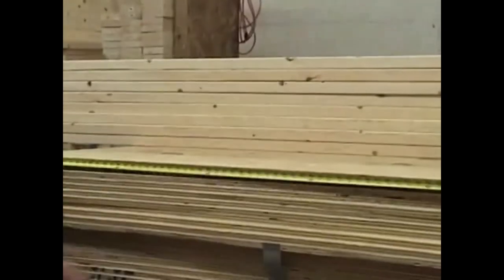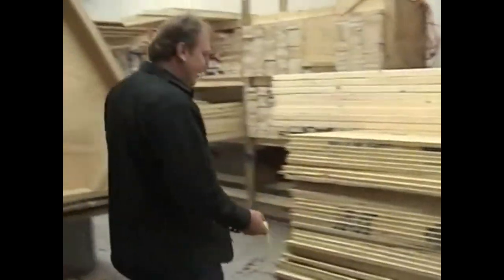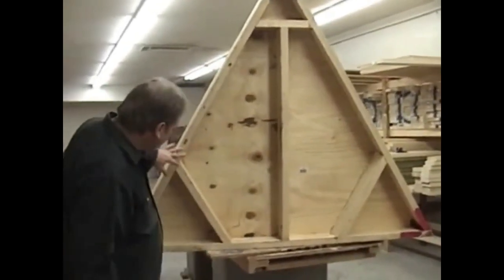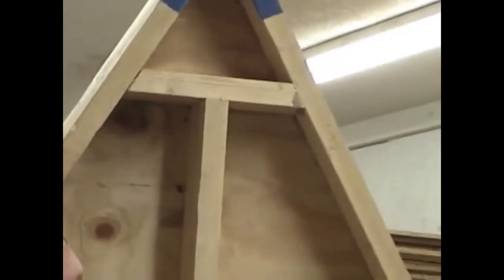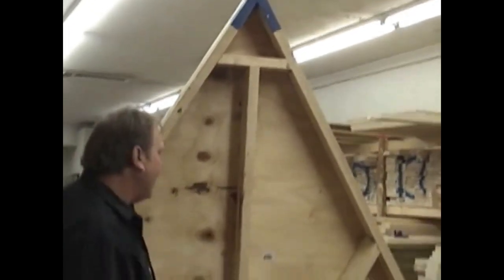Like this is a 78 — that's what it's supposed to be, a 78. All these joints, you'll see when we erect them. We'll show you how to cut the blocking, how to lay that out. We're getting ready to cut these up to make these little T's that fit in here. So everything's prefabricated.